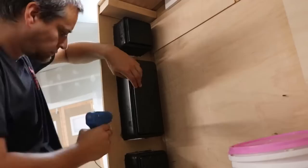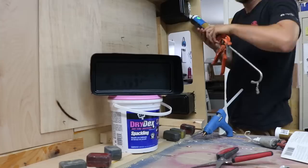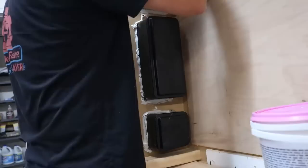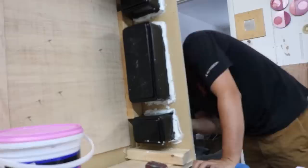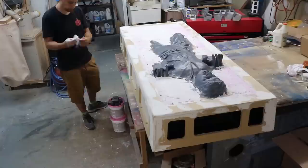You can see that piece of wood right there — that was what I was clamping and screwing in place to give it that edge support. This pocket had a little crack in the corner, split along the edge, so I used some CA glue to do the repair — just a couple of drops and squeeze it together for a second or two. This is the liquid nails I'm using to secure the pockets to the frame. I was grinding down the screws off the back — you could also, of course, just use shorter screws.